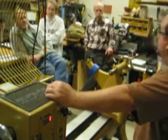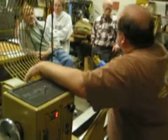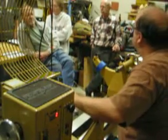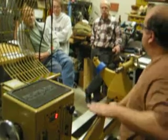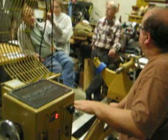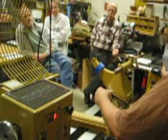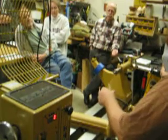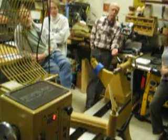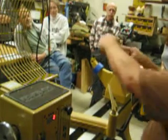I had a question earlier about tool elevation, and you said later. I thought you meant how to set this up. Well, obviously your tools are at different heights. This should be striking the wood basically in the center, just above center. The center of the width of it, not the center of the length of it.